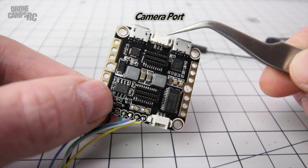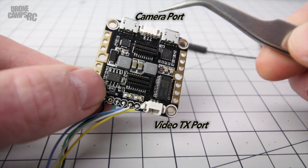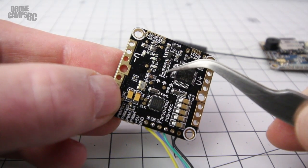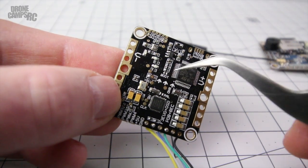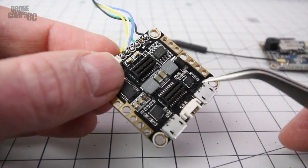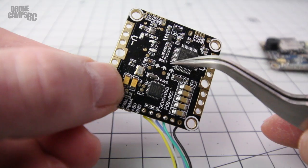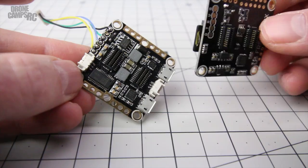The very top port goes out to your FPV cam - that's your video output, and video in goes here. If you need to reflash this board, the boot pins are down here - they're actually two tabs that you have to bridge with a little solder and then unbridge when you're done. That's kind of a drawback; I'd like to see a boot button somewhere, but there's so much going on this board it'd probably be impossible to add one.